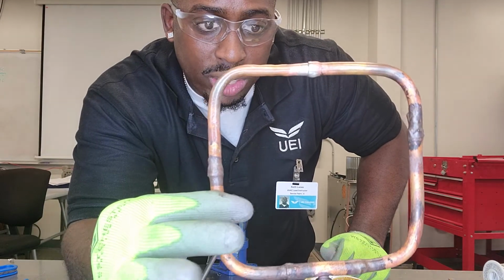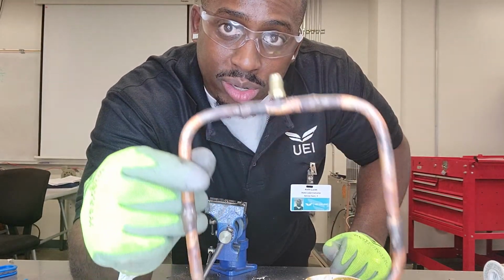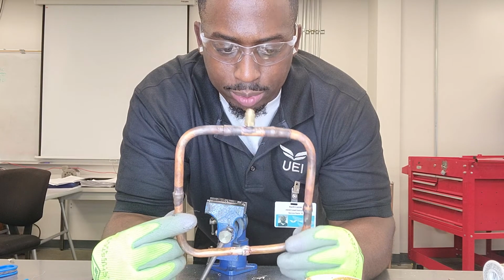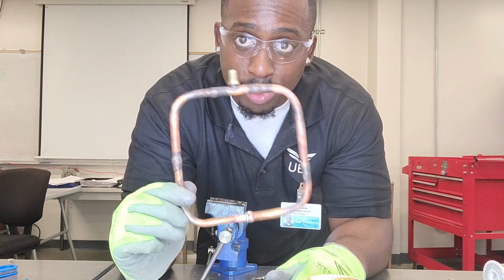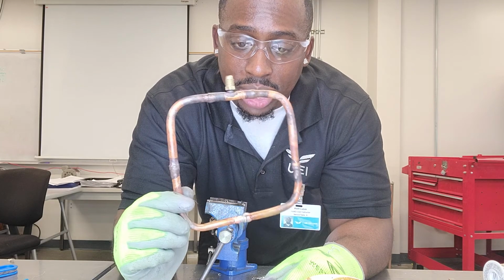However, all these joints are sealed. They formed a perfectly good bond. They'll hold the pressure of your system. So they all work. They just have different temperatures, which gives you different speeds on each joint. But they all work. They all serve the same purpose. That is my little project. On the next video, I'll go ahead and pressurize this with nitrogen and leak check it.